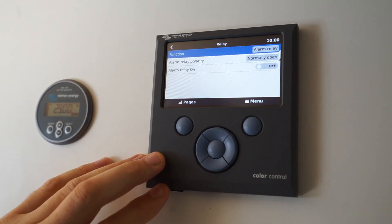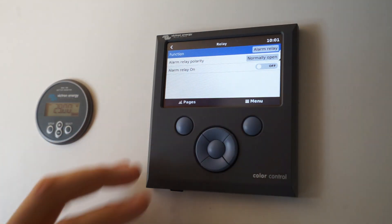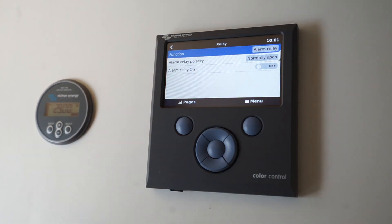Tank and pump — I really should look into that; it would be quite cool to control my water pump from this control panel. There are also relays on Victron equipment, which I'm looking forward to setting up. The Color Controller has a relay that can be configured to turn on or off in certain circumstances — for example, at a certain voltage to turn on a water heater. Stay tuned for the next episode where we talk about individual devices connected to the controller and look at the hardware. The third episode will look at the VRM Victron portal — a website where all the data is pumped to the internet so you can view and control everything from anywhere. Pretty awesome stuff — I like it.